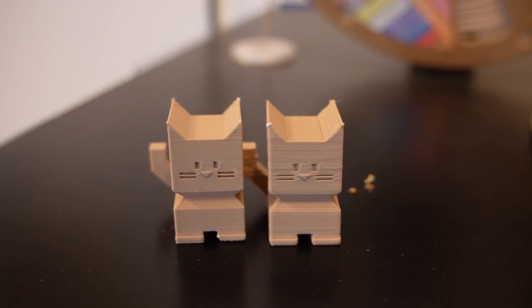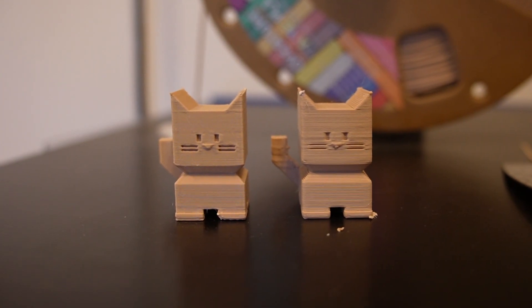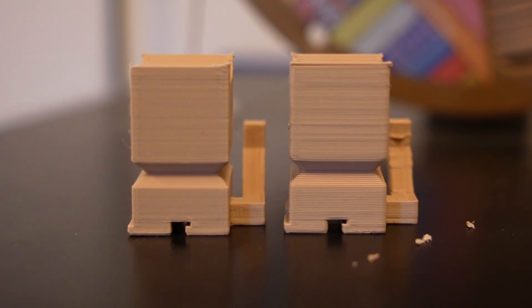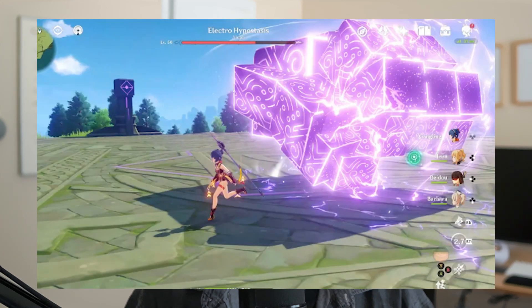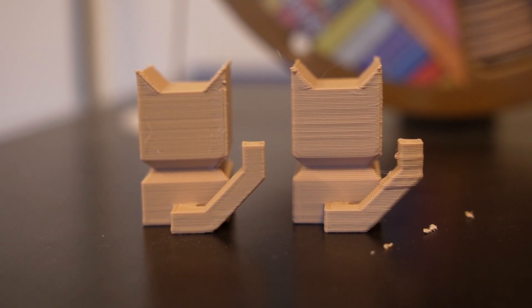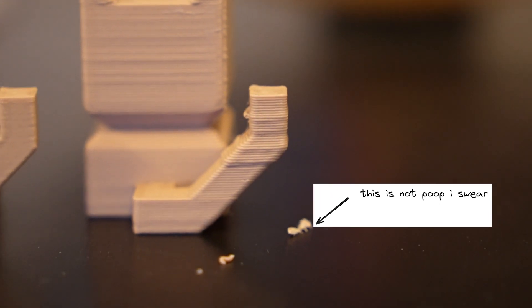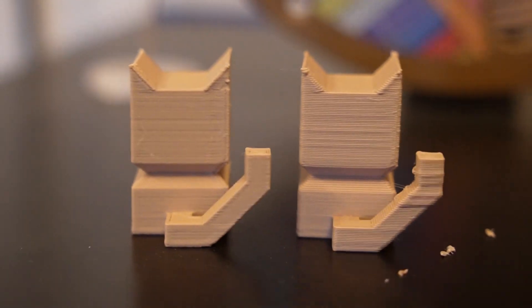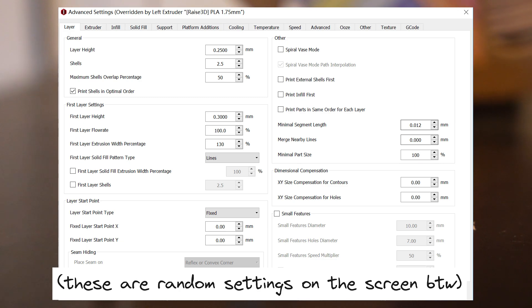Comparing the quality of these two prints, I would be lying if I said I couldn't tell the difference. The slicer I'm using, Idea Maker, doesn't seem to have the same level of optimizations for a 0.6mm nozzle on the Ender 3v2 that Prusa Slicer has for Prusa 3D printers. So I'm taking a pretty big hit in print quality, but I don't think it's a huge deal since I'm usually not printing knickknacks — I'm usually printing larger, more geometric items like mounts and stands. You can see some artifacts on the 0.6mm print, especially on the tail, that the 0.4mm print did not have. I suspect these issues could probably be worked out with more time spent tuning settings like flow rate and retraction.